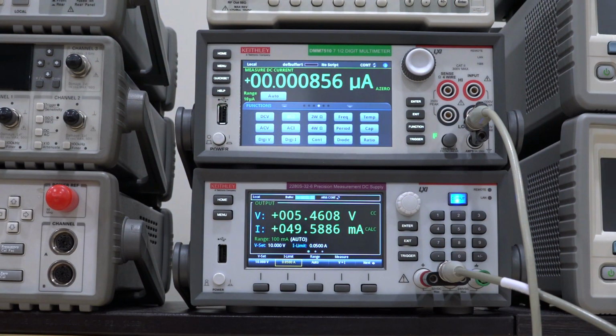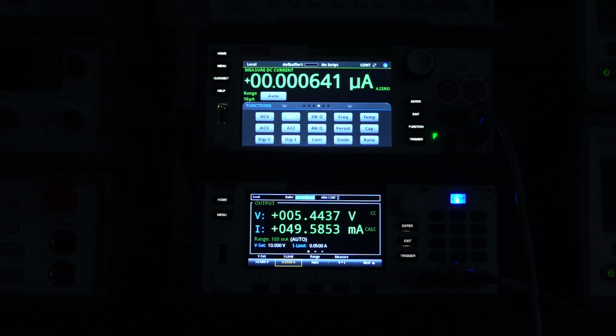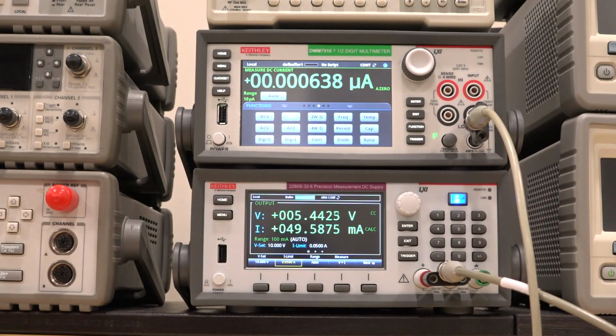So if I go back to the measurement again, and you take a look, again, if I shake my hand and move my hand around and block the ambient light, I'm indeed going to cause some problems in the measurement. And this is not just because of light. EM being present at different frequencies, being picked up by the wires themselves, is also going to interfere with such a sensitive measurement. So this makes it very difficult to do this measurement. Let me turn the lights back off again. There you go, light off. You can see the current drops. Light back on, comes back.